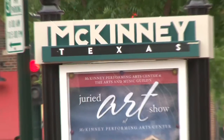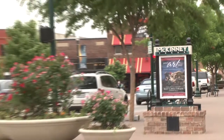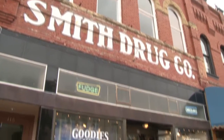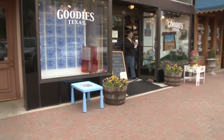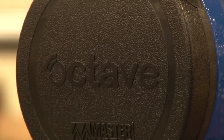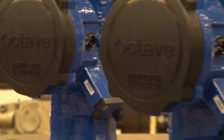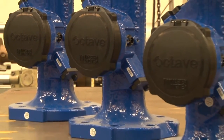We're always looking at trying to capture every drop. And if you look at household use on a running toilet, we have toilets that have run and cost customers 6,000 gallons in a day. So if I have one of those in one business where there's a large compound meter with the Octave, I'm going to get that one toilet in the middle of the night when they're not there. The low rate of pickup for the Octaves allows us to gain more revenue from that, and we can track more water loss in our system that way.